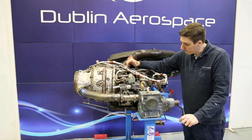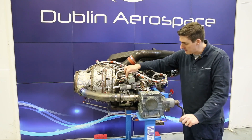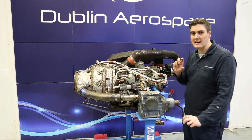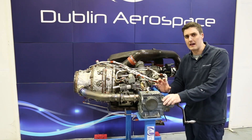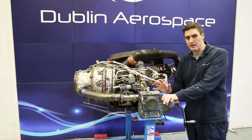There are also a set of flow sensors on the APU: a differential pressure sensor, a total pressure sensor, an inlet pressure sensor, and an inlet temperature sensor. All of those sensors are used to analyse the airflow and pressures being produced by the load compressor and to control the APU.